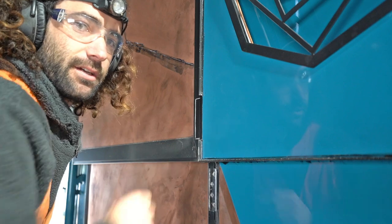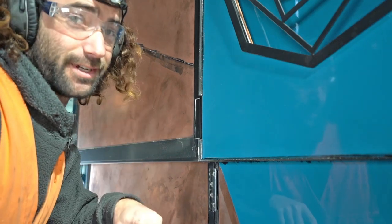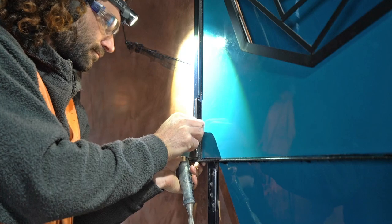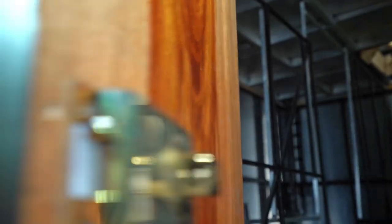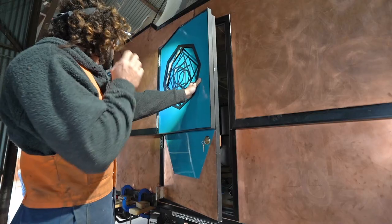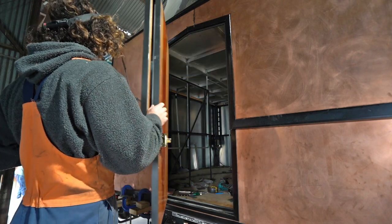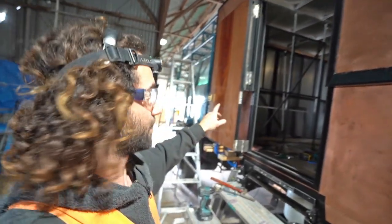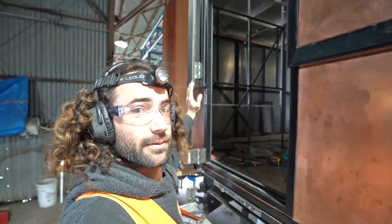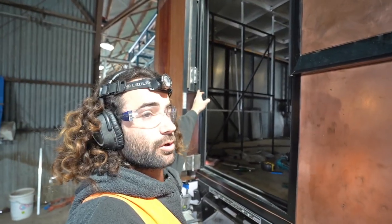Just checking out this little bit of trim here — it is possible to cut aluminium with a sharp chisel, although it's not very good for your chisel, but it can be done. That's three out of four hinges on and it's opening pretty nicely at the moment. But this one hinge is the real troublemaker — it has to be really well aligned with the other one, otherwise we have the same problem where it tries to pull the top wall off the bottom wall.